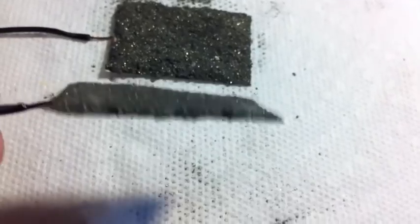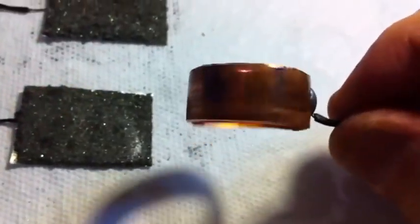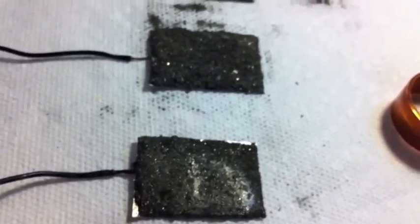The magnesium layer is less than one-tenth of a millimeter, and it will corrode away in a day or two. I'm going to use this copper board that I showed in previous experiments — it's pretty dirty by now, but I'll clean it up and put those cells on it. First though, I want to measure voltage between the magnesium and a copper ring. I'll put my meter on the voltage scale — it's at zero now — and connect the magnesium to the positive terminal. I don't want to destroy my sample; it's so fragile.